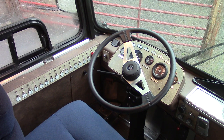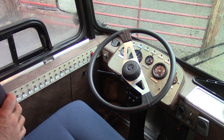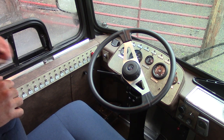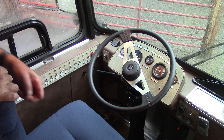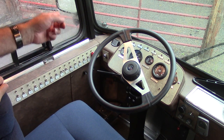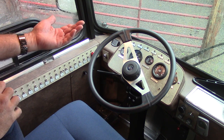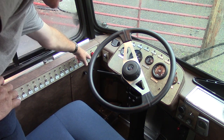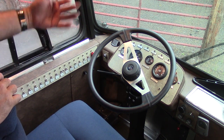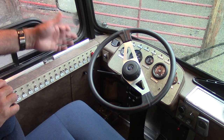This is the driver's cockpit layout. The chair does have arms that come down — I'm just pulling them back up out of the way. This is the starter switch right here. This is the emergency stop switch, which when you trip that, it drops a flap across the air intake of the engine and shuts down the diesel, in case you had a runaway diesel or something like that. This is the master switch, which turns on all of the power from the batteries to the bus system.